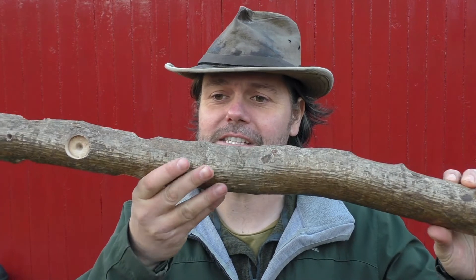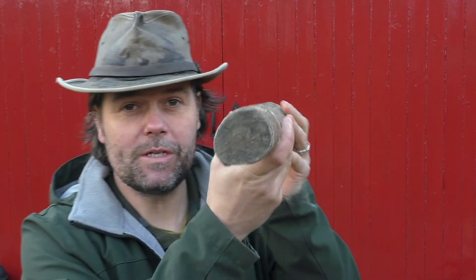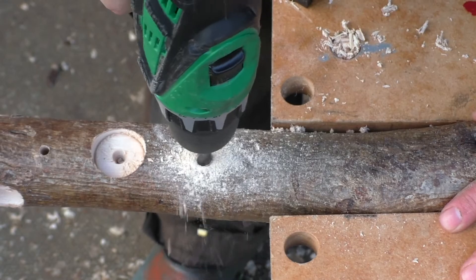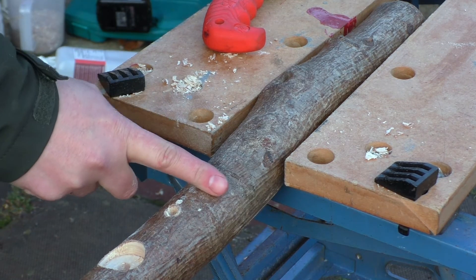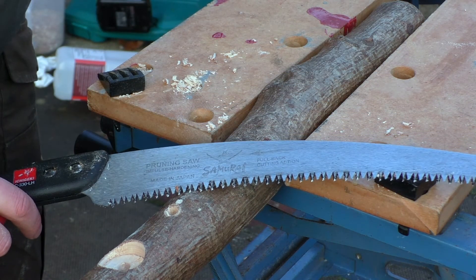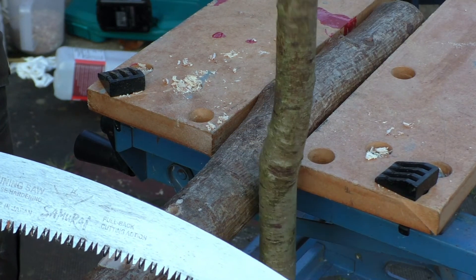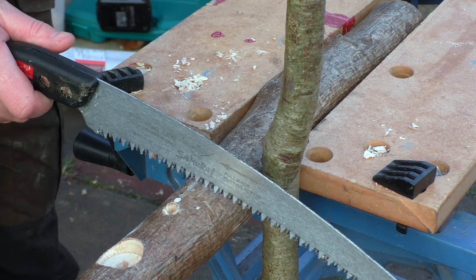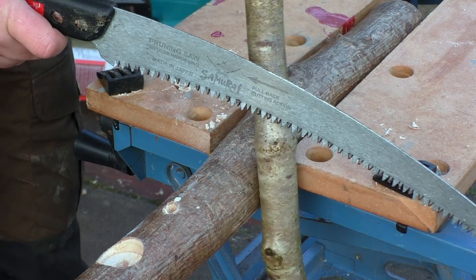It's especially important with the perches that whatever you do on one side you do on the opposite side as well, because we want it to hang nice and evenly. The last hole is again with the smaller drill bit and it's going to be at the top of our bird feeder — for the string — so it's got to go all the way through one side and out the other. Pick the thinnest section of the log because wood is never perfectly round. Right through the other side. Now it's finally time to saw the piece off where we want it.